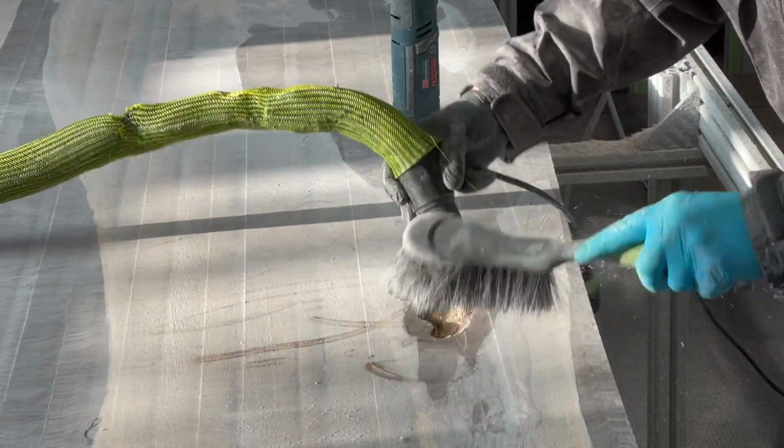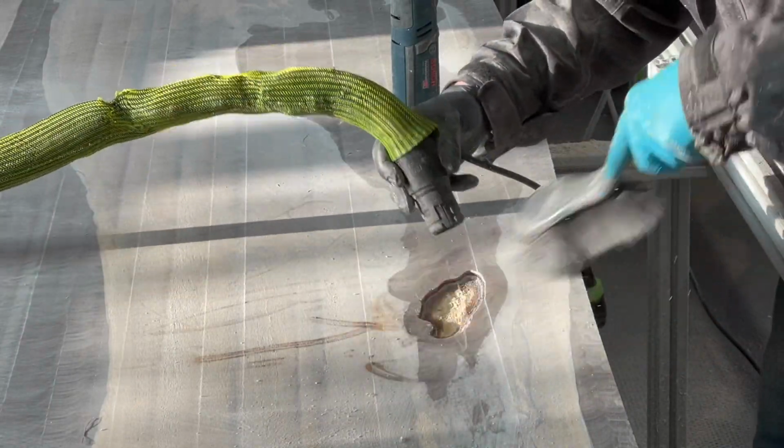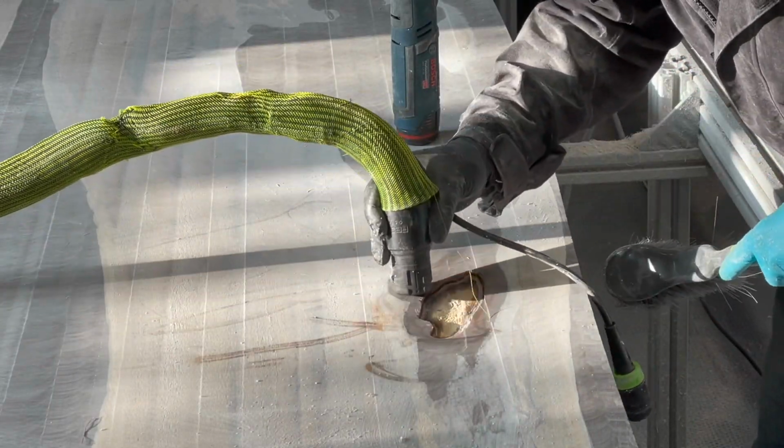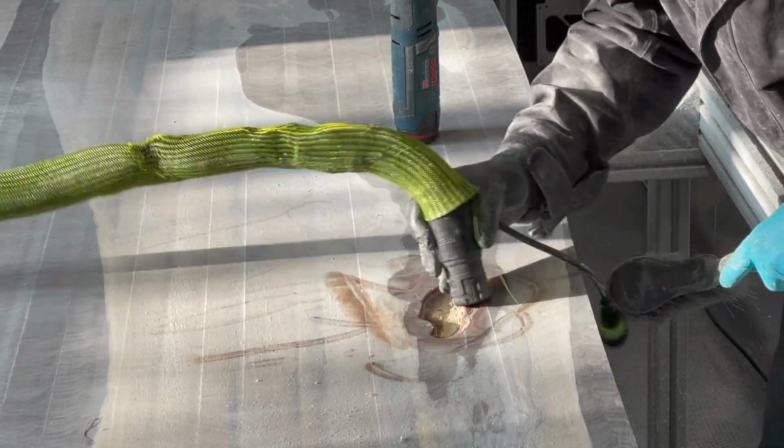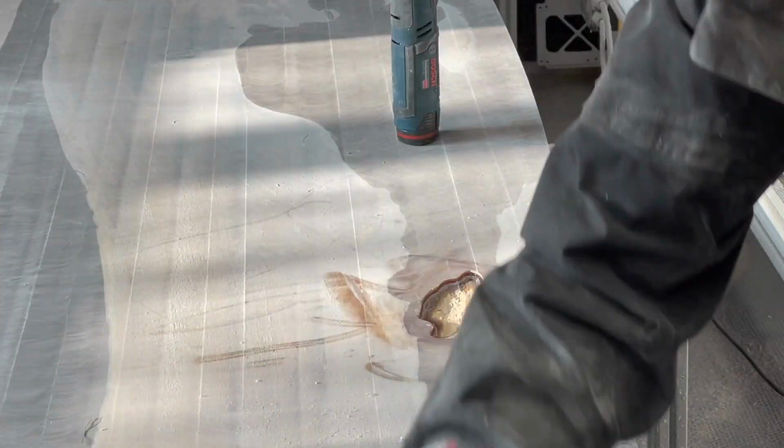This is the underside, so we don't have to really worry, but you do need to deburr the edges, re-pour the resin, let it set, and come back to it. I'll use Glass Cast 3 here, so it's going to set much quicker, and I'll be able to sand this off tomorrow.